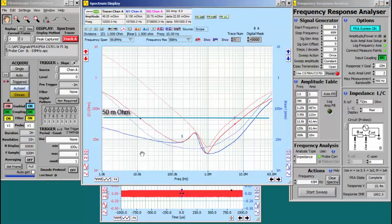So you can see it here. And so in terms of our 50 milliohm thresholds, beforehand we were at 187 kilohertz, but now we are at 50 milliohms there, 11 kilohertz. Put a marker there, and it's improved slightly up at higher frequency because we've got parallel capacitors. Looking at 50 milliohms, which is about there. We now go to 9.6 megahertz.